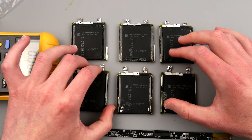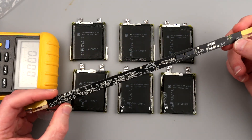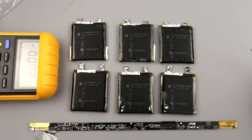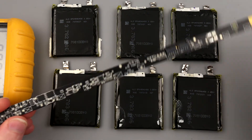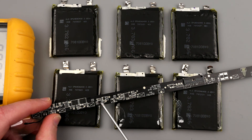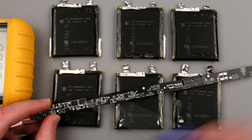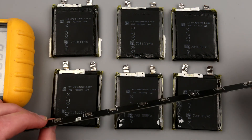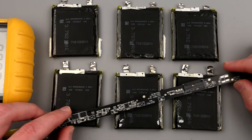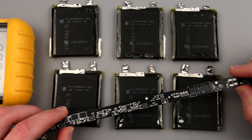It's an interesting question why this battery pack died and why two batteries cropped out, because this is a relatively new power pack and they're usually supposed to last long. There may be a high failure rate in these batteries. Looking at the controller board: this chip here is a TI charge controller, this is an EEPROM containing all the charging parameters, these two are the beefy MOSFETs, and this one is the fuse. I can't really reuse this charge controller for other battery packs because the chemistry parameters of each individual battery are recorded in the EEPROM.